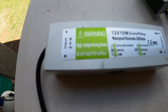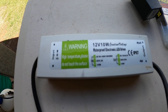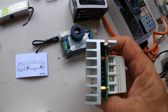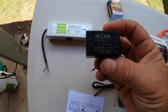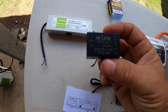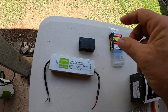I've also got AC to DC converter modules — 90 to 250 volt AC input with 12 volt DC output, 10 watts — just to run a little fan on the inside to cool off the controller. There's another one here which is a 2 amp version, also with 12 volt output and 240 volt AC input. On one side you've got your input and on the other side your 12 volt output to use inside these boxes.